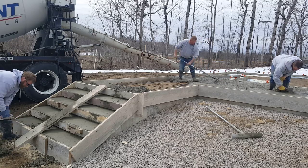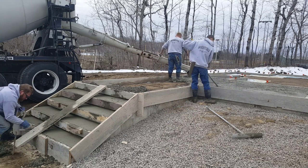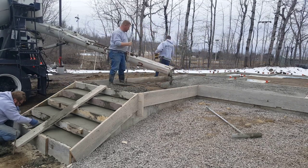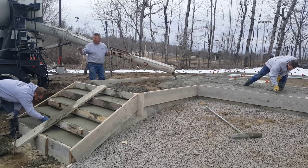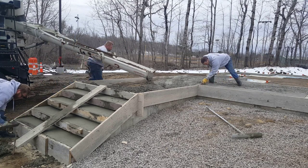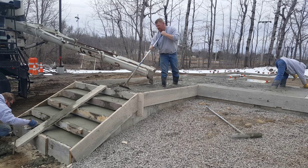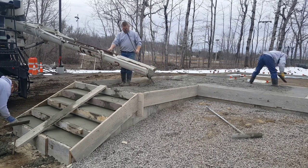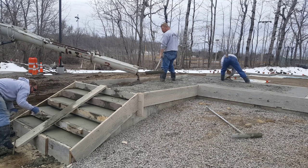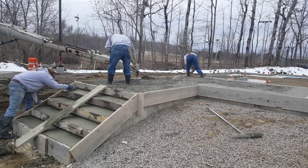We're just about done roughing in those steps — Darren will finish it up. I'm going to go up and start magging the edges on that concrete patio. I'm going to vibrate the edge first. Once we strip that board off, that edge is going to be exposed, so we want it nice and smooth. That DeWalt pencil vibrator, man, that thing's awesome. I would highly recommend getting one — I'll put a link down in the description. It's kind of expensive, but it pays for itself in the amount of labor it saves you when you strip those boards and you don't have to patch anything. Just vibrating that edge makes a difference. Luke's getting the concrete poured out — he's kind of a one man gang there. I'm magging the edges.